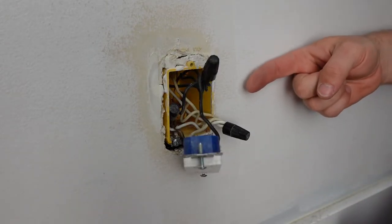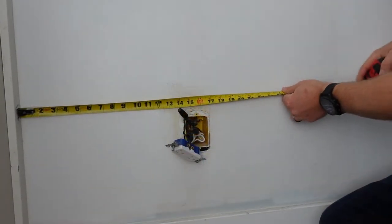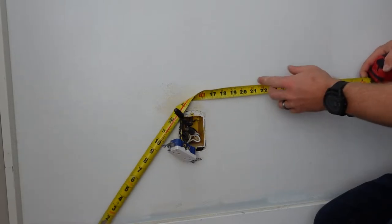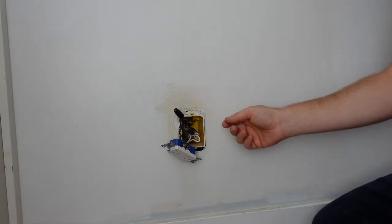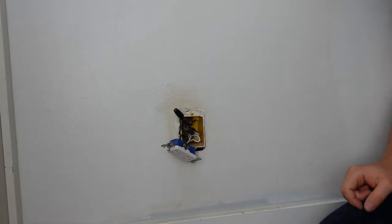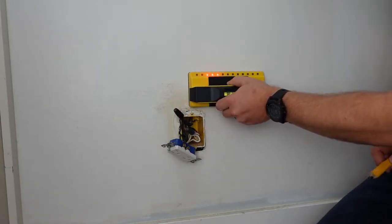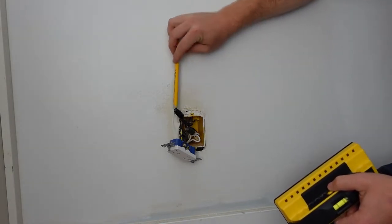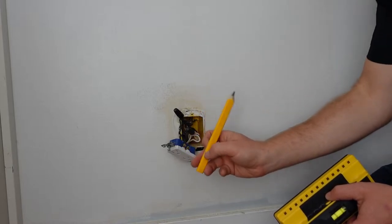The idea is just to run another cable that jumpers into this existing outlet, running the wire from this box up to above the TV. The TV started at 24 inches but we gave ourselves a little buffer room, so 26 inches is where we're going to build the new box. It's very easy to go up vertically since that's just a cavity or insulation, but if there are studs in the way of our wire run it's very difficult. I'm going to use the stud finder to see where the studs are — where there are lights, that's where there's a stud. There's a stud here, which is unfortunate. There's usually a stud on the left or right side of outlets.